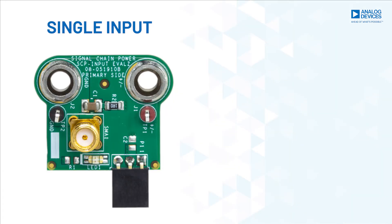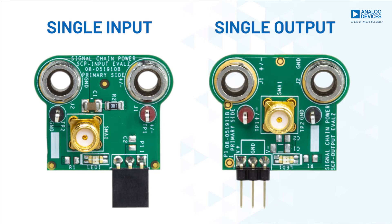The SEP platform also has single input and output connector boards for use with simple one or two rail tests. Like the breakout boards, they also feature banana and clip lead connections for bench equipment or DVMs, and also provide bi-directional red-green LEDs for a quick visual representation of both applied power and polarity.